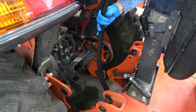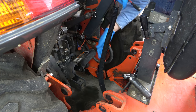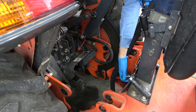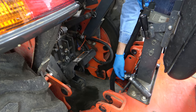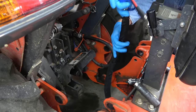I've completed the wiring on the backhoe and on the tractor, so it's time to marry the two back up and do some initial shop testing — checking range of motion and making sure no hoses are being pinched or pulled in ways I don't like. I wanted to show you close up how this all hooks up: there's the port that goes back to tank, the hose that goes to the pump, and the electrical hookup. It's important to ensure clearance between the quick connect and the PTO shield, and that the hose has room to route correctly.